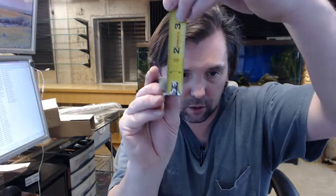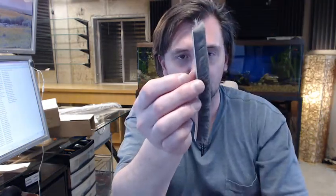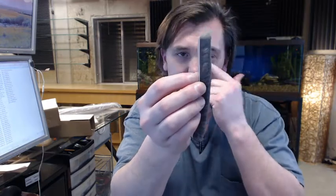Now, we have given you the width of the backer, the thickness of the backer, the width of the pile. Now let's give you the projection from the back of the nylon backer to the top. It is going to be a bit hard to show that on the camera, but we will try anyway. It looks like you are going to be at about 5/8ths — let me measure that here on the desk. Yeah, 9/16ths of an inch from here to the pile. You can see that it is pushed over slightly, so you are going to be anywhere from 5/8ths to 9/16ths.